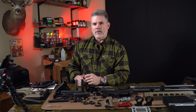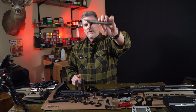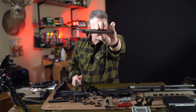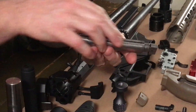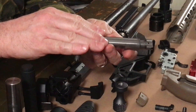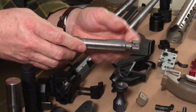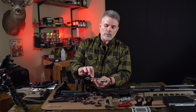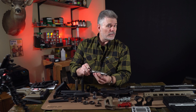One last part of the rifle that, while maybe not surprising that it weighed a lot, is something you might not think about: the factory bolt on the RPR, with the bolt handle, literally weighs just over 10 ounces. That's actually quite a bit of weight — it's a large bolt body made from steel. We're obviously not going to do anything with the bolt head, locking lugs, or bolt face, but we will send it out and have it fluted, which will relieve quite a bit of steel around the body of the bolt, so we're looking to get a couple of extra ounces there.